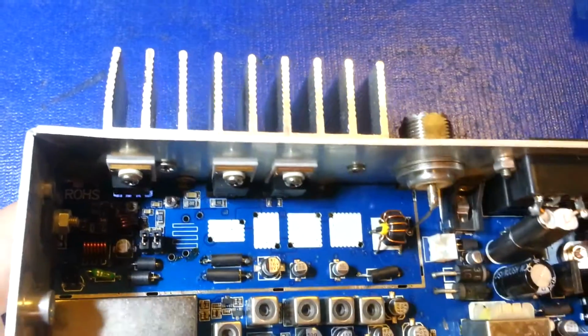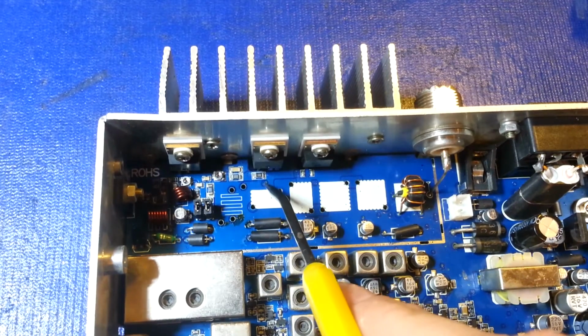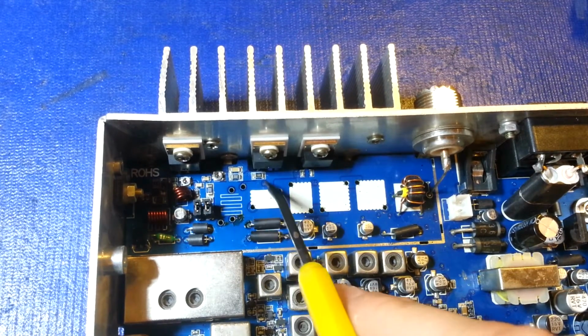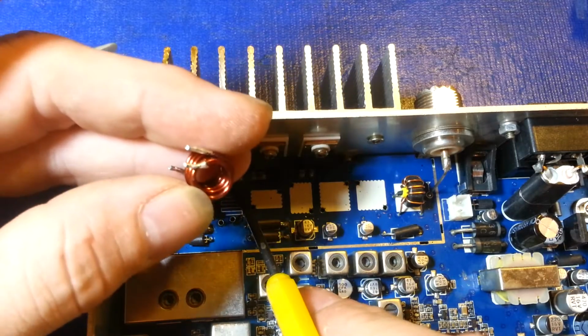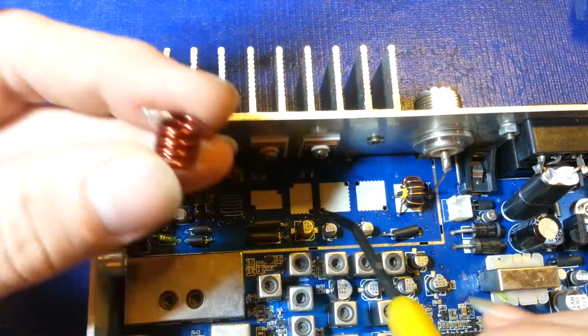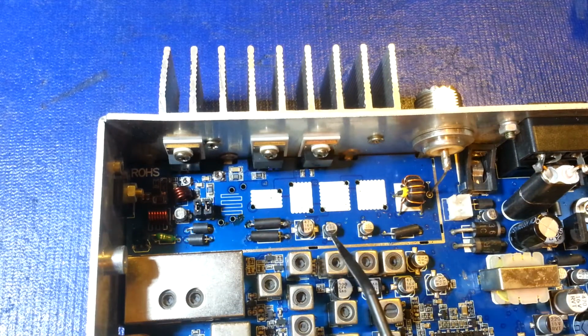And now if I probe right now with an ohm meter from this pad to this plated through hole, I do have continuity. But when the coil was installed in here, I did not have any continuity, measuring off the tip of this. And what it was, was bad solder. I think the customer said this radio has been worked on two times before for poor solder joints. Then it's obvious.